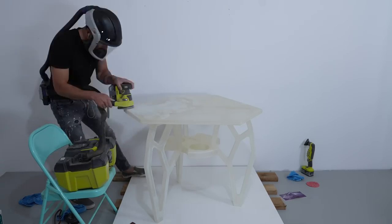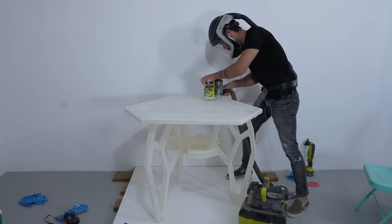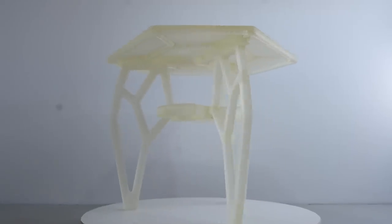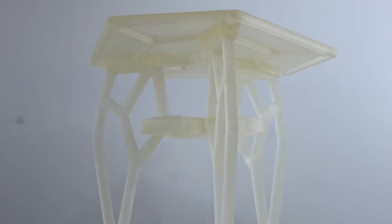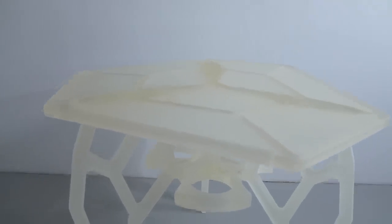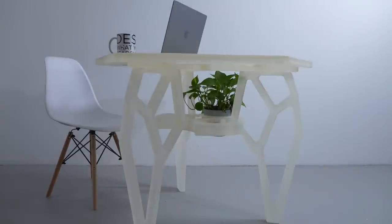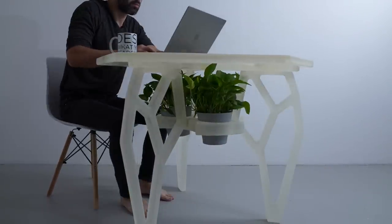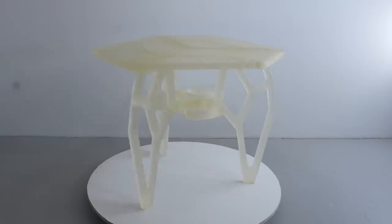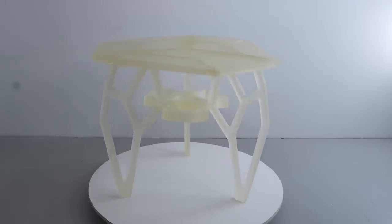After scraping away the silicone I got out my orbital sander, my Ryobi vacuum box, threw on my space helmet, and sanded the whole thing with 320 grit paper. From there I switched to my Ryobi polisher — this is a fantastic tool for epoxy projects. It has these big sponges and you can use polishing compounds of different grits to get the exact finish that you want. In this case I'm going for a soft sea glass matte finish. The tabletop is just under half an inch thick in its thinnest portions but almost two inches thick around the legs. I really like this aesthetic of mixing something space age and futuristic like the epoxy with real plants — it's like futuristic without the dystopian stuff. I have heard from maker friends that large epoxy tabletops can droop over time particularly if they get too warm, so I'll keep an eye on that. If that was a problem I would probably just intentionally heat it up, flatten it out, and laminate a layer of fiberglass onto the top to create some tensile strength.